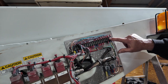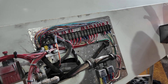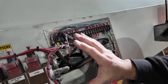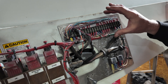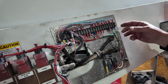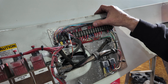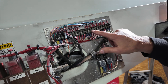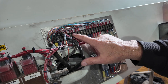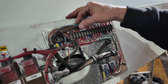Also, if you look at this panel right here with all these connectors — obviously this is out in the open. There's a cover that goes over it, but that cover doesn't make it watertight. When you're driving down the highway at 50, 60 miles an hour, anything — road salt, moisture, rain — can all get in here and cause corrosion on these terminals. So that is another problem area to keep an eye on if you're having an issue.